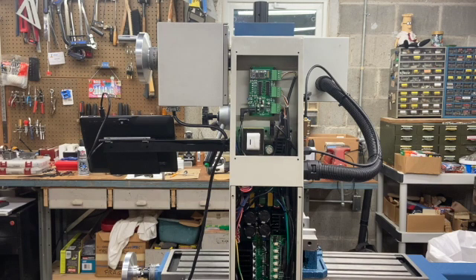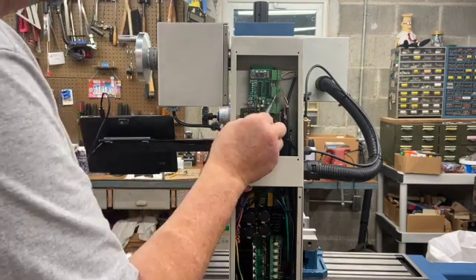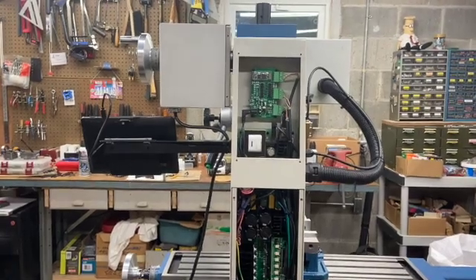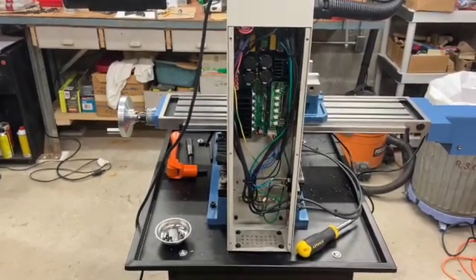My experience is that a loose connection can cause havoc — sometimes you get intermittent connections and it just plays heck with troubleshooting because it's not consistent. So I went in with a little screwdriver and checked the terminal screws to make sure everything was tight and the connectors were on good. Unfortunately, three or four of those screws were flat loose — didn't seem like they'd ever been tightened. That was a problem waiting to happen, so I went through and snugged everything up. There were a few more that were kind of loose too, and you don't want to put gorilla torque on these — just snug for good electrical contact.